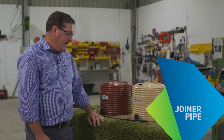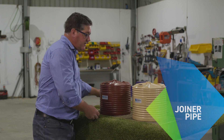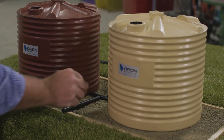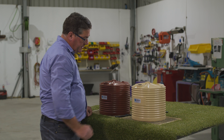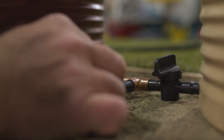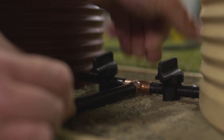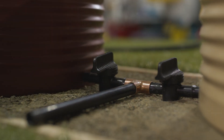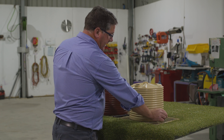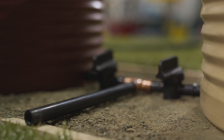The other way that we can manifold tanks is to put a joiner between the tanks. In this instance, what we would do is put a connection here in between the tanks and then run another pipe out to the front and away like that. That way it achieves the same result — it's the same net effect — but keeps the pipework and the valves back inside the line of the tank installation. If there was another tank on the other side we would simply have another connection with a joiner out to the manifold which runs across the front and away to your home or shed.